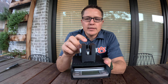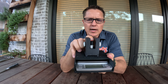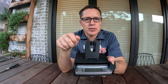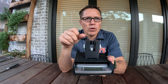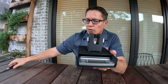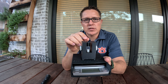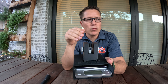I added something unique that I haven't seen done before: the spring dampener system. The reason I added this is there are a lot of comments on other testers saying results are biased, because people are striking the filament and it causes the filament to break at a lower grams reading than is actually true. The way this works is the knife hits the spring dampener, you push down slowly, and it contacts the filament in a controlled fashion. It also prevents the knife from moving laterally across the string, which would not be captured by the scale.